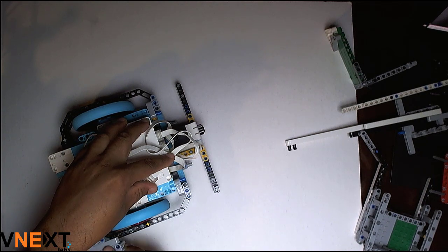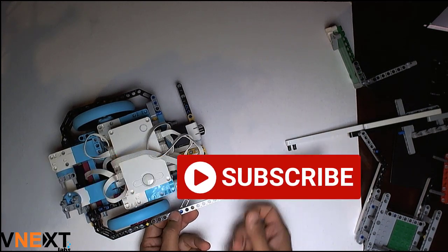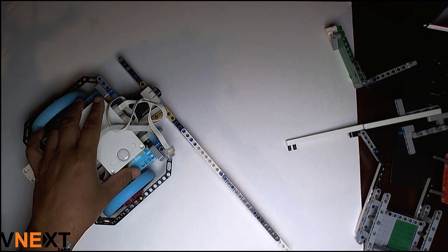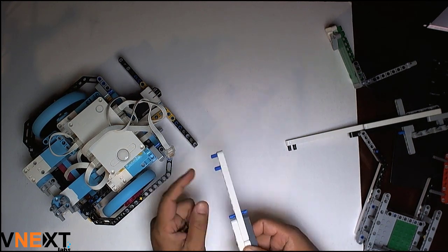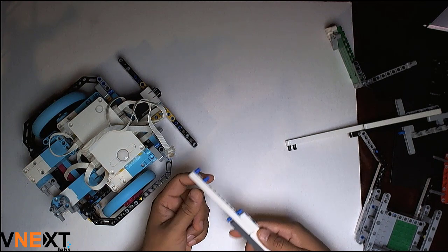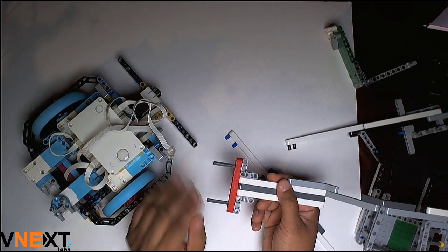You can put static attachments on the sides as well, with suitable interfaces. For example, we can put this attachment over here, or a static attachment elsewhere, depending on what serves our purpose. There are many different options. If the load is small, we can proceed with a small axle feature sticking out, or we can go with a much longer axle-based interface so that the engagement is more significant.